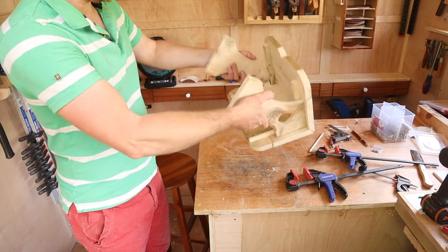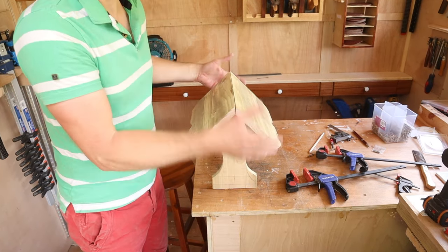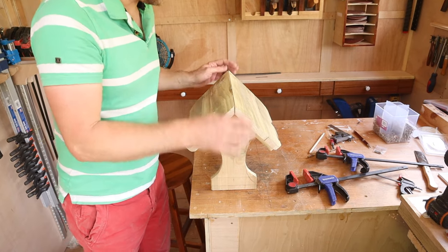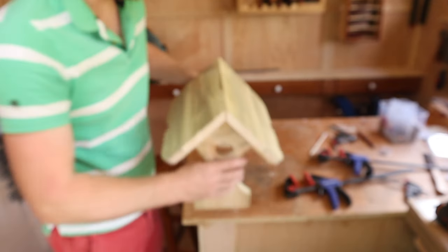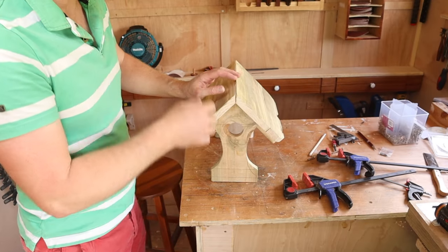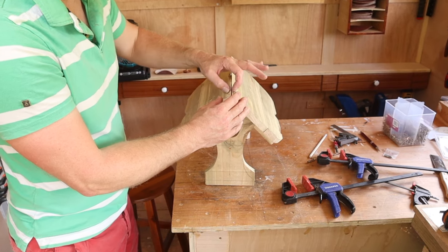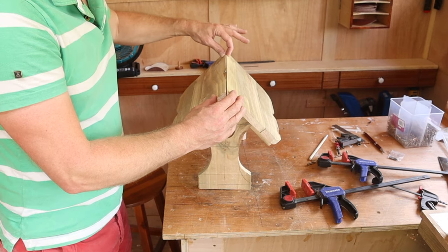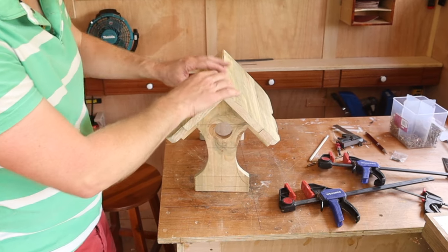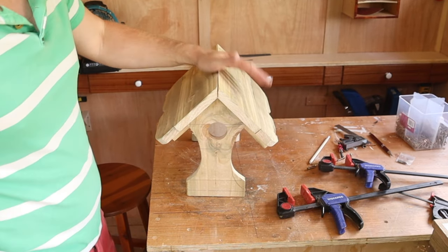We've got the top of our birdhouse, and you know what? It sits really flush. So by copying all the different measurements down, that's come out really well. I will say the top has not met perfectly, but I'm not too worried. I think what we can do, either take a plane across the top and just put a piece of wood flush on the top that will then act as the top of the roof and stop any moisture getting down there. And to be honest, it's mainly aesthetics. I'm not worried about moisture getting in.